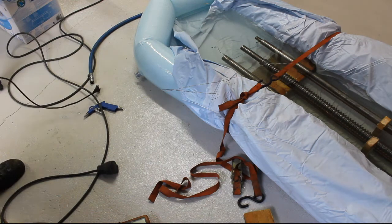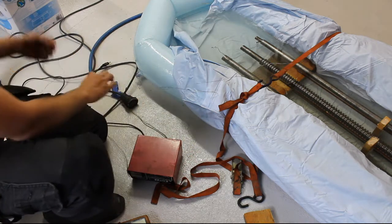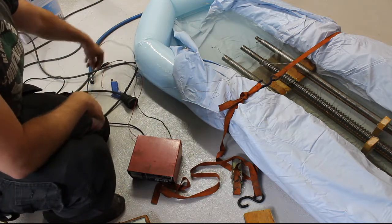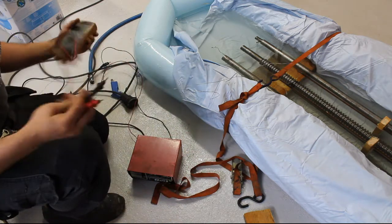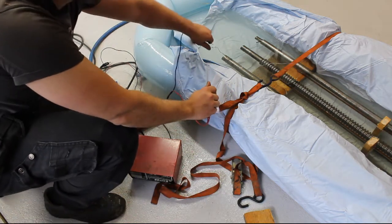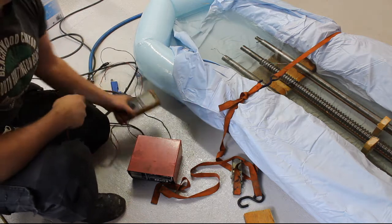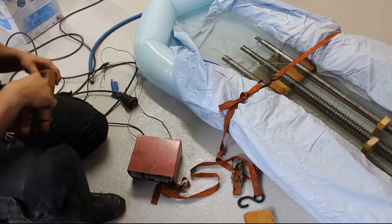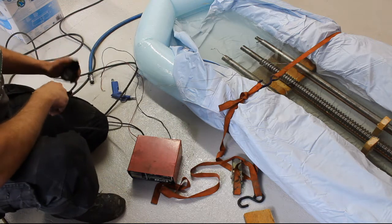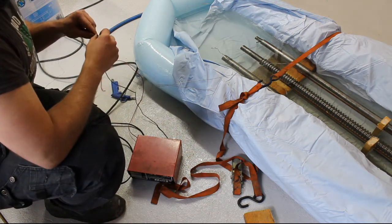Now the things are set up in the tank, and the next step is to hook it up. Two important things here: the part to be cleaned goes on the negative side - otherwise you're going to rust it up - and they can't be touching so you don't short them out. I just like to take a quick reading on the resistance, and it gives me something around 20 ohms.